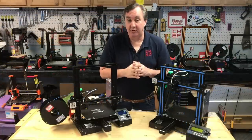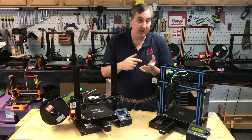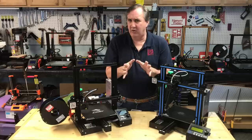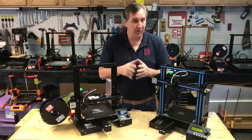So now that we know our magic number is 0.04, we can do variations off of that for the Z height: 0.08, 0.12, 0.16, 0.2, 0.24, 0.28, and 0.32. You typically don't want to go more than 80% of your nozzle diameter, so at a 0.4mm nozzle, 0.32 is the roughest you want to go — and that's pretty rough.